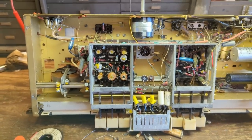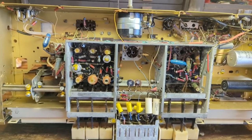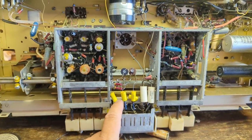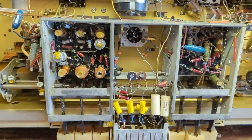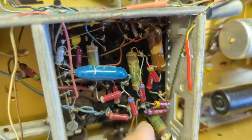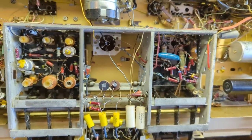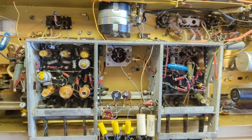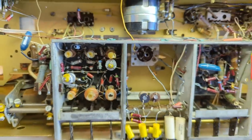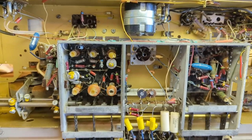I have to admit I didn't make it far. I decided yesterday I just wasn't in the mood for working on German radios, so I put it aside and worked on an All-American 5 radio. Now I've brought myself back to this and I've started the recapping process. Once you've done this enough it becomes just more drudgerous than anything. It's just looking at what value is written on the cap itself - like here it says 0.02 to 250 volts. You just replace like with like. You do have some flexibility - if you don't have any 0.047 caps and you've got some 0.068s, totally fine. These little bitty caps that are clear plastic, you don't need to replace those - we're just going to replace the paper caps.